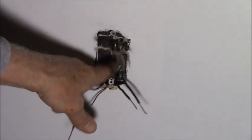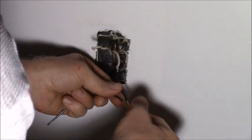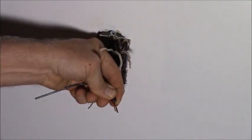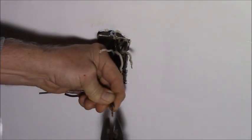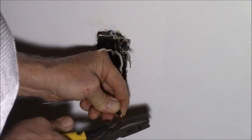Now I'll see the rest of these two, there's three wires. Now they've got these in there wrong too, but there's nothing I can do about it. They've got two wires through the same clamp. I don't know, maybe that passes code. We never did it. One wire per clamp in a box. So I got my insulation shoulders all lined up together here. And that looks like that would use a yellow. I got two yellow. With me? Yeah, I do. Okay.